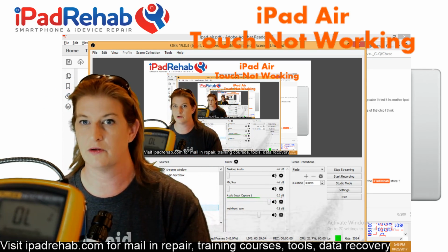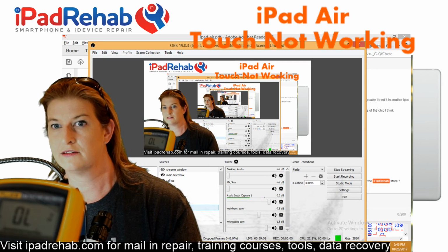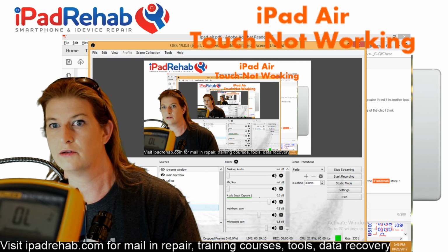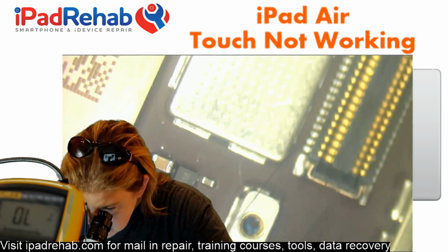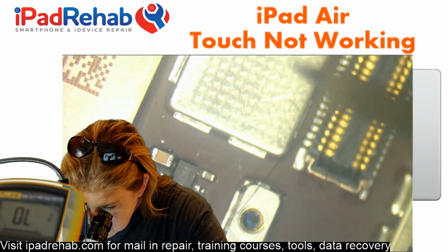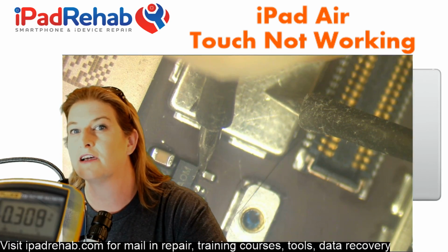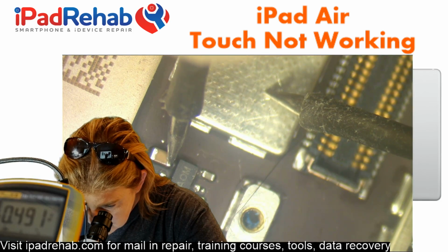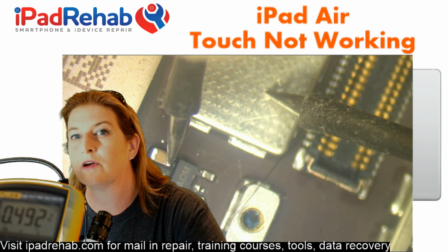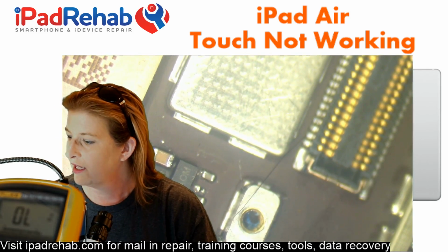Let's do that. We'd be silly to not find that out first. So in diode mode, let's look at the microscope, and microscope cam, where are you? Schematics, go away. All right, let's just test for short to ground in diode mode. So let's see what the diode mode reading is here. The diode mode reading is 0.311. And here it's 0.492.